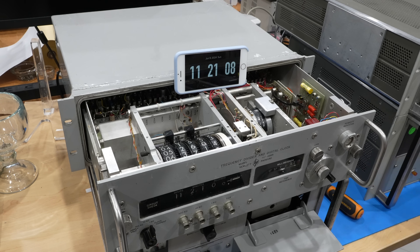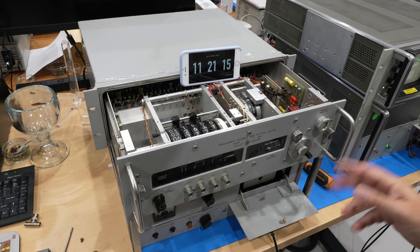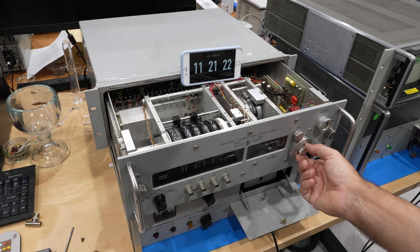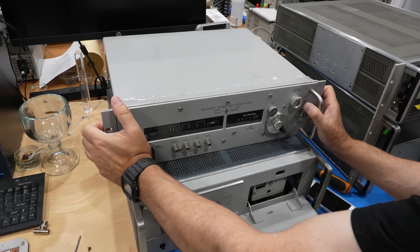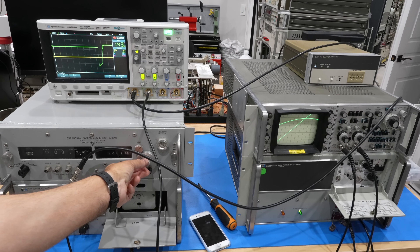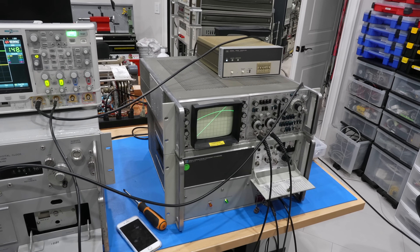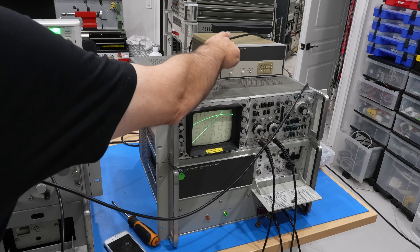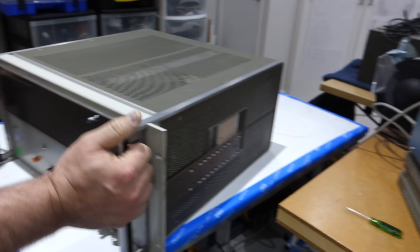Approximately good. And then you get a tick from the worldwide radio, or the Colorado atomic clock, and you put it on an oscilloscope. This thing gives you a tick precisely in microseconds, and you get that going. I won't put the cover on because I want to change it — I'll put it on the atomic clock. So now we are going to try to use the fine control to synchronize the two. Unfortunately, my cesium clock doesn't have a divider for the one pulse per second, so I have to use this with the external clock input. What you are looking at at the bottom of the stack is an HP 5061A, a portable cesium atomic clock.